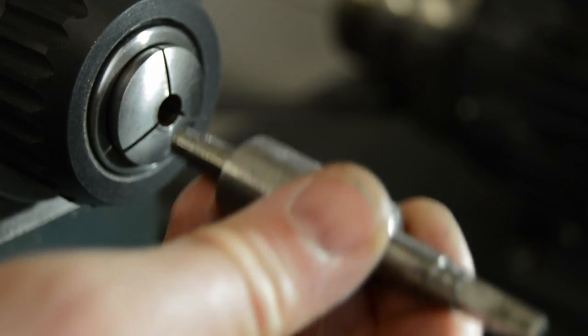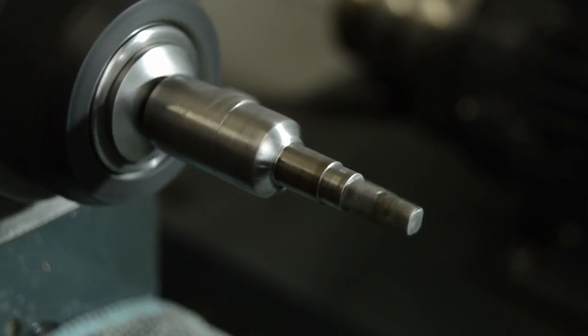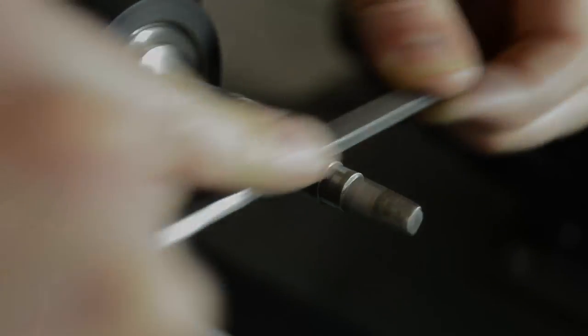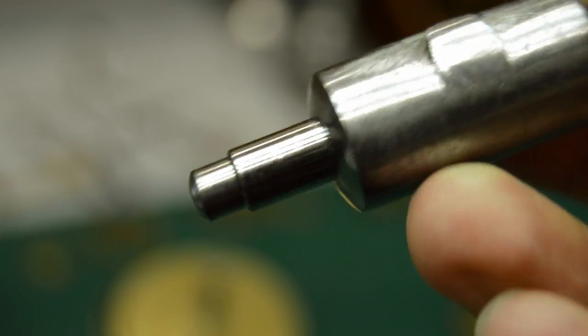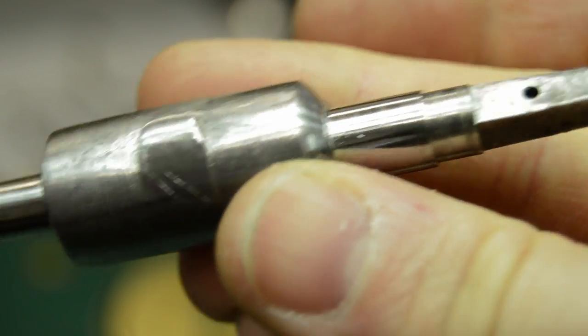Now, when a mainspring barrel bearing gets very worn, the barrel has a tendency to tip over onto one side. As this becomes exaggerated, it can cause a braking effect by taking up the end shake of the barrel against the barrel arbor, and also causing a drag on the bearings themselves.